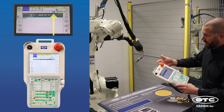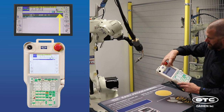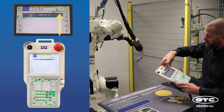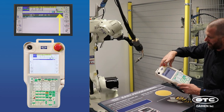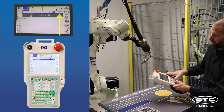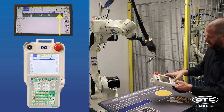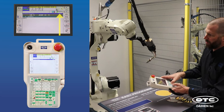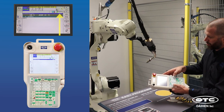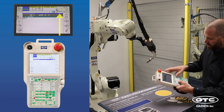The speed at which the robot moves is selected here for manual speed. You can touch it to change from a speed of one through five. Speed five is the fastest. Speed one is incremental — it moves about one millimeter for every time the key is depressed — so you'd only use that when fine-tuning the program.